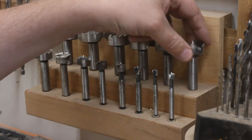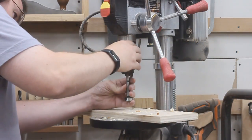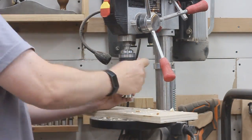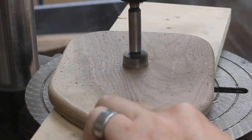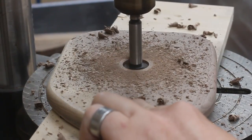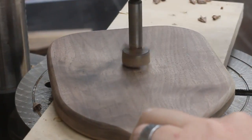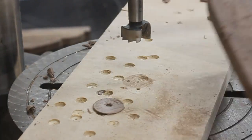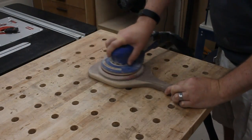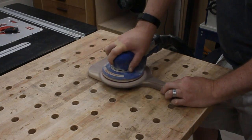Now I need to punch a hole through the center of it for the main twister thingy to stick through. I chucked in a one-inch Forstner bit and then drilled at my mark. I was sure not to blast all the way through — instead, I stopped once the tip of the brad point went through so that I could drill from the other side to complete the hole. This eliminates any tear-out and keeps things real crisp. A little bit of sanding and the paddle was done, ready to deliver some spanks to some unruly children.